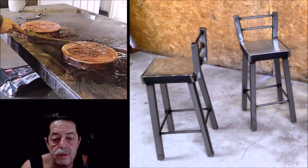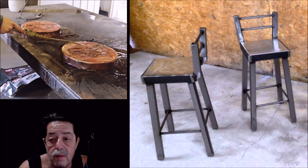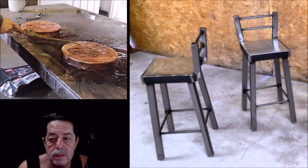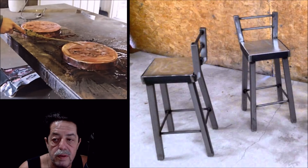You can also use angle iron — you can buy it from a steel supplier, it's still very cheap and comes in 20-foot lengths. You can put it together or use rectangular tube steel. You can use sheet metal for a seat which is easy to keep clean, but I prefer wood seats — people aesthetically like them a lot more. You weld the seams and use a four-and-a-half inch angle grinder with 80 or 120 flap discs to take the welds down and smooth everything out.